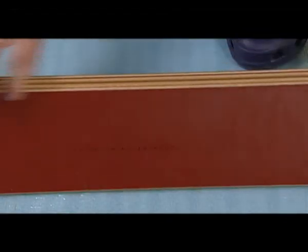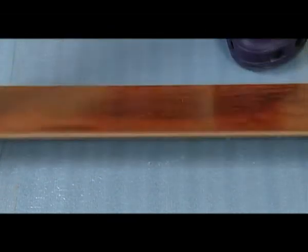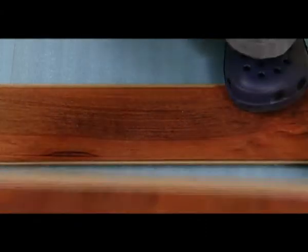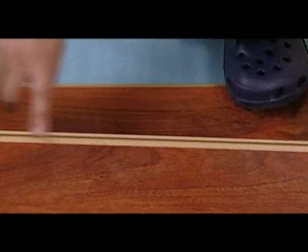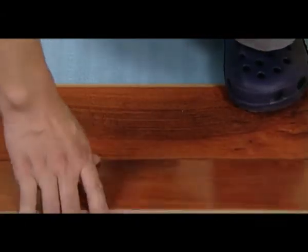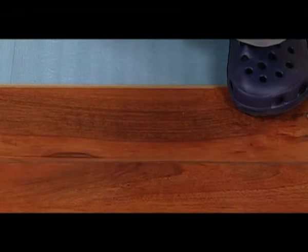First converse panel. In case of converse installation, please start from right to left. Place your feet on the row where you need converse installation. Position the long side low hook of the first converse panel into the long side uphook of the previous row panel. After positioning, you should see there is a gap along the joint area. Then use the rubber mallet to tap the uphook joint area. The panels will lock into place together.